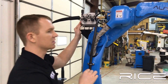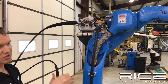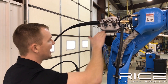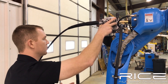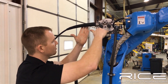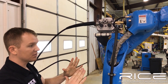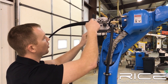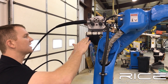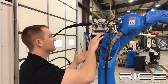I'm going to touch on this feeder just a little bit. It's a robotic wire feeder, and it looks a little plain Jane, but there's nothing wrong with that. All internal gearing — none of your gearing is on the outside. And exposed rollers: the great thing about exposed rollers is that in a robotic situation, you'll usually see something with a cover on it. If you're not using the best wire, the coating or debris from the wire will build up and eventually arc off. With exposed rollers, it all drops off and we're good. Also, all your solenoid components are accessible from here.